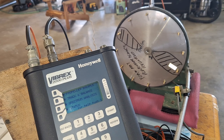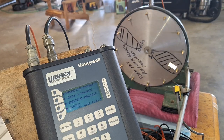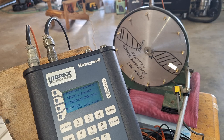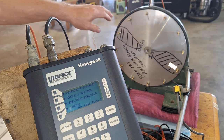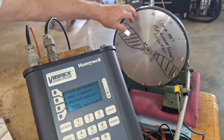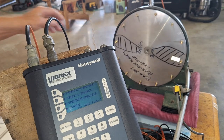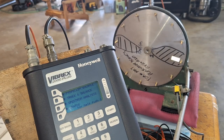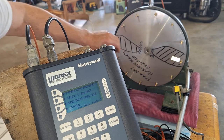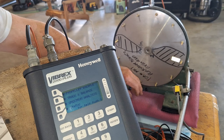I built a little test rig here. I bought a disc sander and drilled a bunch of holes in the disc, mounting screws corresponding to clock positions. This thing rotates in the same direction as a propeller on a normal airplane, so clock angles are measured from where your vibration sensor is mounted — I've mounted it at 12 o'clock, which is the normal position on a piston engine airplane. I've got a reflective target mounted on the disc; that's the optical sensor that gives it the position.